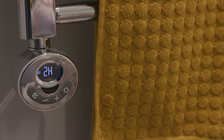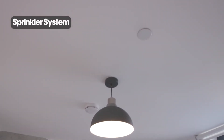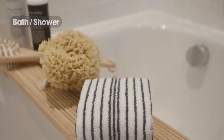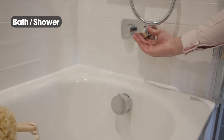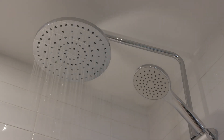Further information on setting up user-defined schedules can be found in your home user guide. There is a sprinkler system installed throughout your apartment. In a fire situation, the white cover cap will drop from the sprinkler valve if it reaches a temperature of 57 degrees Celsius. The fusible link within the sprinkler valve then has to reach 74 degrees Celsius before releasing water to fight the fire. These are life safety systems — these caps are not to be touched, removed or covered. In the bathroom, you can change the water temperature of both your bath and your shower very easily, and switch between the standard fixed shower head and the hand-held head.